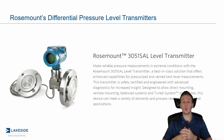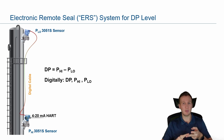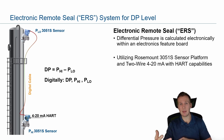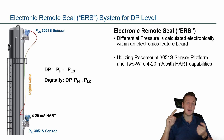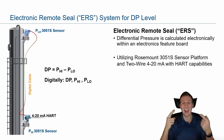More specifically, we're introducing the concept of Rosemount's electronic remote seal system for DP level transmitters. The idea here is: forget about wet and dry legs, forget about capillaries — let's just use two transmitters, connect them via an electronic cable, and digitally calculate differential pressure with an electronics feature board. This way we have two separate transmitters, which means we also get the pressure on the high side, the pressure on the low side, and the differential pressure between the two.